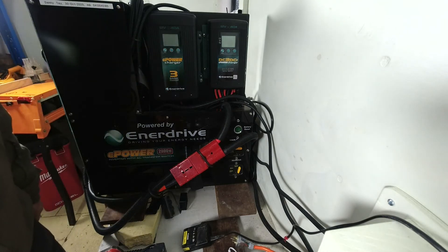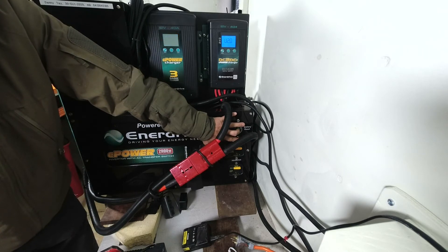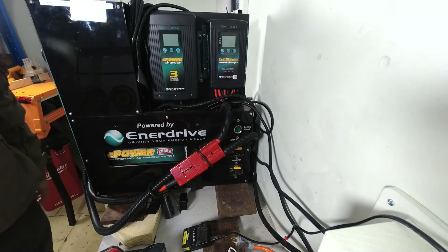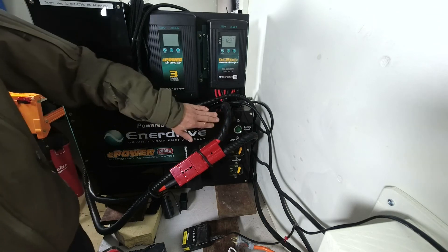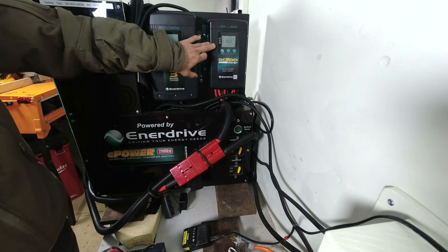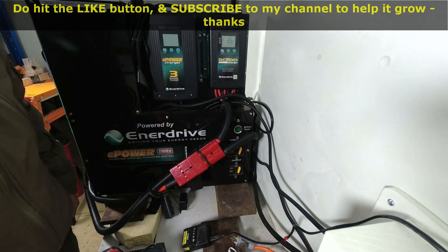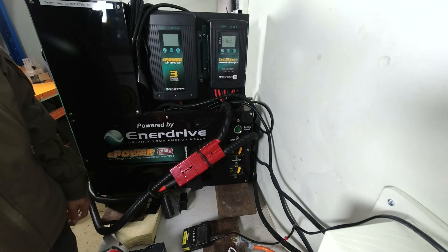It doesn't work — I don't understand why. I tried the battery reset again and it still doesn't work. I'll have to investigate further. I tried a third time pushing the battery reset button and it worked. I can see the DC to DC charger is now receiving 2.6 amps from the 330 watt solar panel connected to it, and the battery voltage is now 12.2 volts from the charging. It seemed that persistence — just trying again without doing anything different — finally woke up the battery management system.